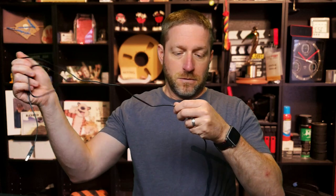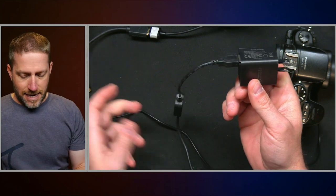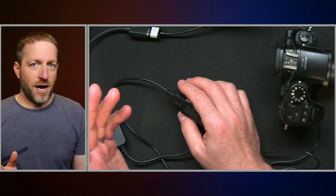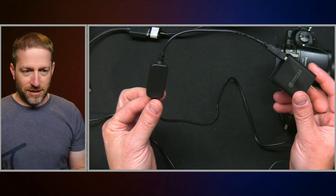Starting with a USB power adapter that does 9 volts — that's the key. This adapter comes with a little USB connector, a voltage converter, a thin cable, and a releasable connector just like the other one, so you can plug it into the part that goes in the camera. I could even use the dummy battery pieces I already have with this adapter. This setup is much easier to manage in a kit, especially with multiple cameras. If you're just using one camera it doesn't matter much, but if you're using five cameras or more, these things start to add up.